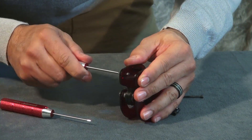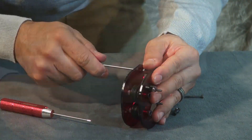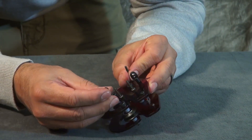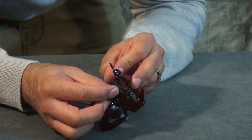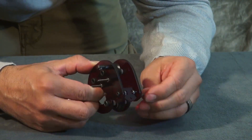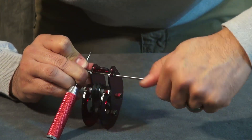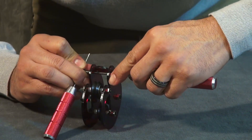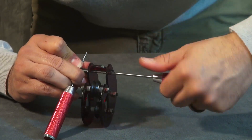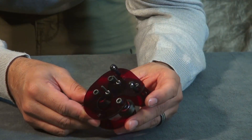What's left is the ball joint and the M3 by 35 bolt. The ball joint goes on the same side as the other ball joint — remember to line it up with your hash marks so it stays straight. It's really easy to go too tight on this one. This part has room for flex, so be careful not to over-tighten — just nice and snug. This is what it should look like when completed.